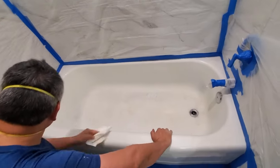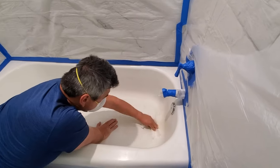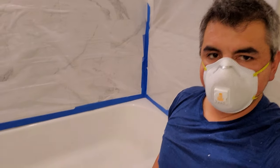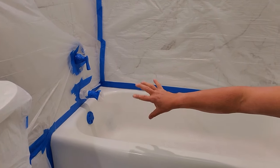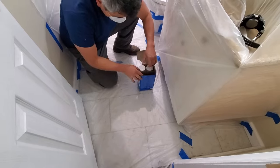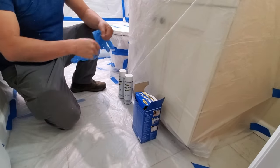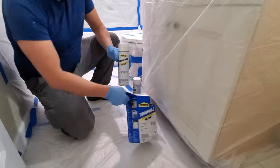You want to make sure it's nice and clean and dry. Obviously, all these areas are taped — you can notice we taped really well around all the edges. Imagine that you're painting a car. You want to cover all the areas around your faucet, make sure everything is nicely sealed. Cover the drain, cover the overflow trim, cover your toilet, your sink — everything around that you don't want little particles of paint falling on. It's better to cover it. You can buy a fine plastic film that you can wrap around everything with just a little roll of tape.